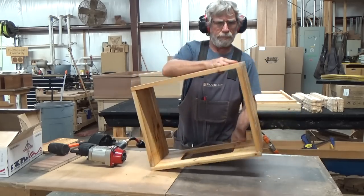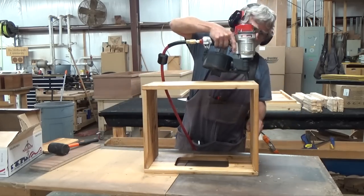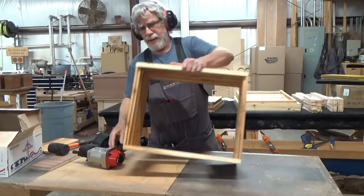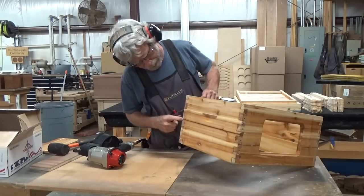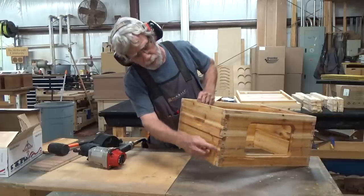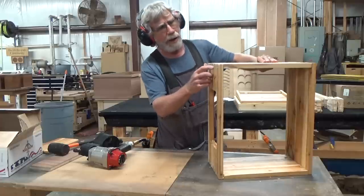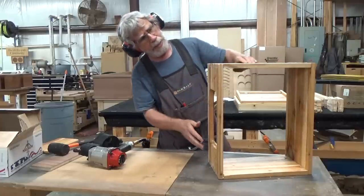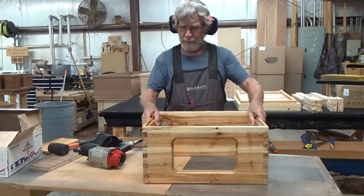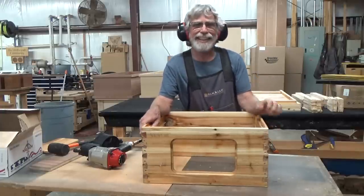It over. And I'm not even going to shoot nails in this front part. There's so many knots in this wood, I'm afraid that nail is just going to blow them out. So I believe the 16 nails that we have in there already are going to be enough to hold this. All right, that was done. Let's go do the other one.